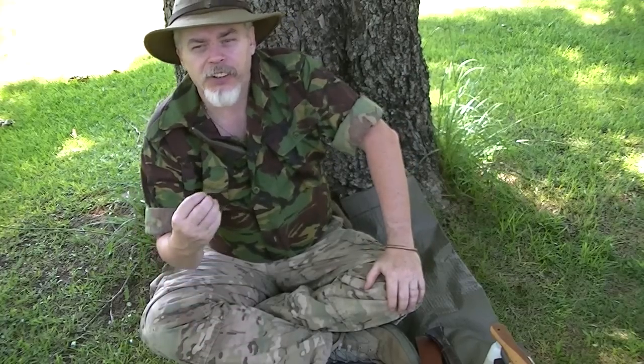Now, let me give you a little lead to this. There are many kinds of steels, and we're not going to get into all that. There are steels that are common, steels that are exotic, and voodoo steels that only a king can afford. But the bottom line is all steel has some sort of grain to it, and that grain will tell you how efficient a cutter it is. When you look at it through a microscope, it will have saw teeth. How fine those teeth are, how clean they cut, and how durable they are is how well the knife holds an edge.